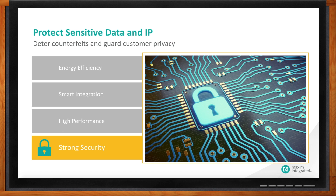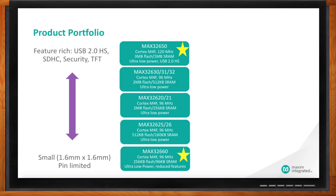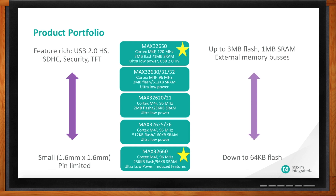Let's talk about some specifics on devices and packages. We've got a nice family of products — all Cortex-M4F, around 100 MHz. We've got a bunch of devices already out in the field and very popular in wearable fitness devices. More recently, we've released parts that are the bookends to the family. The one at the top is 3 megabytes of flash at 120 MHz — a pretty beefy processor with a lot of peripherals. And then there's one at the bottom which is probably the smallest Cortex-M4F device available on the market today.